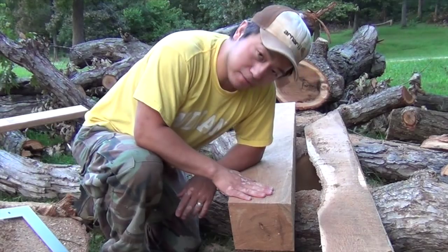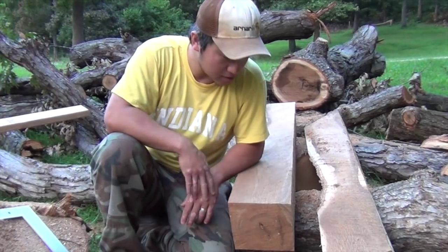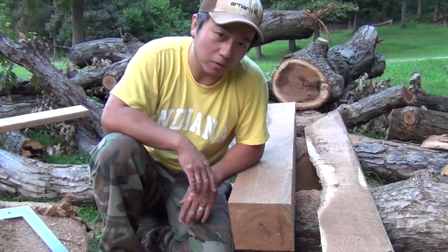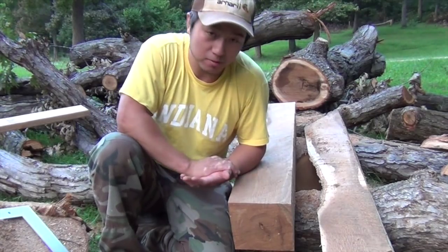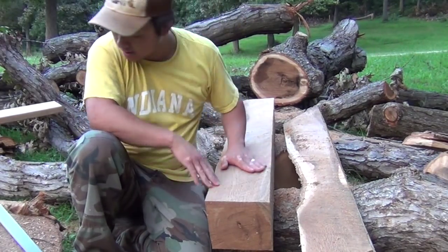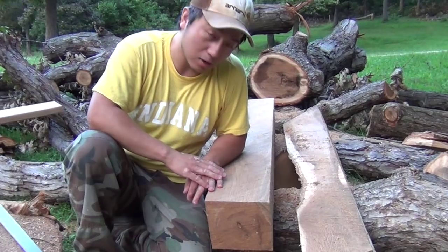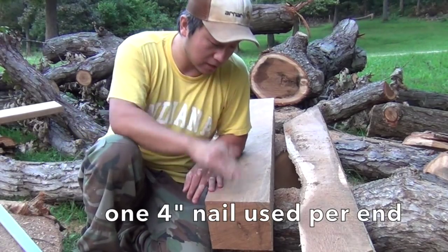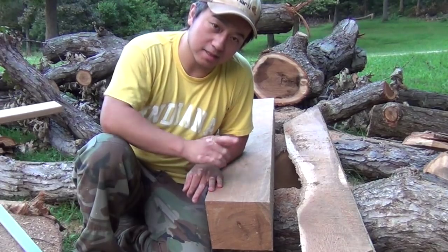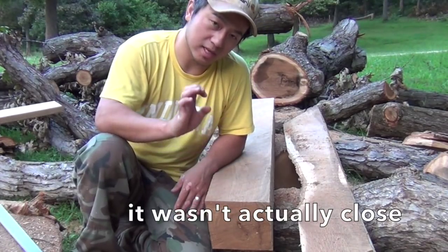I hope you enjoyed that. It was my first time trying it — definitely a learning curve. One thing is it uses a lot of oil. My chainsaw went through probably half, if not more than half, of the oil that was in there — it was full when it started — and about a third of a tank of gas. The chainsaw itself is 60cc. As for the 2x4 guide: make sure it's nice and straight, and you only need one nail — nail it flush and that bar will ride up against it really nice. Also, I do think this could be dangerous to the toes, because I was standing on one side and cutting on the other, and a lot of times I felt like my toe was getting a little too close to the blade.